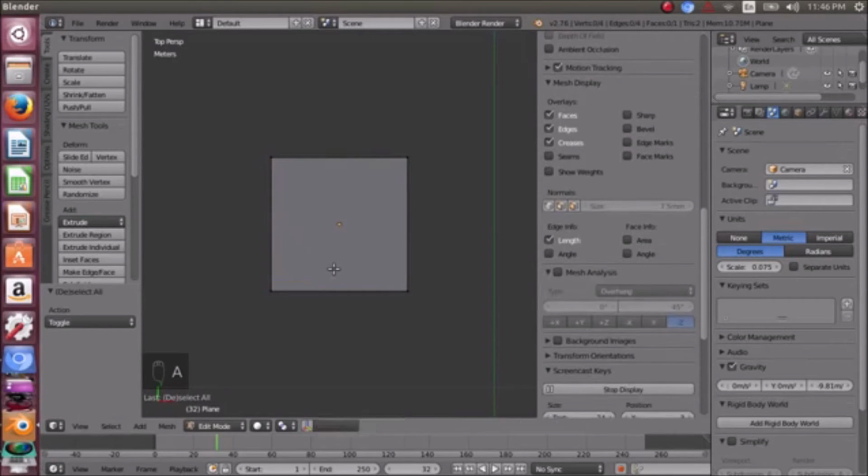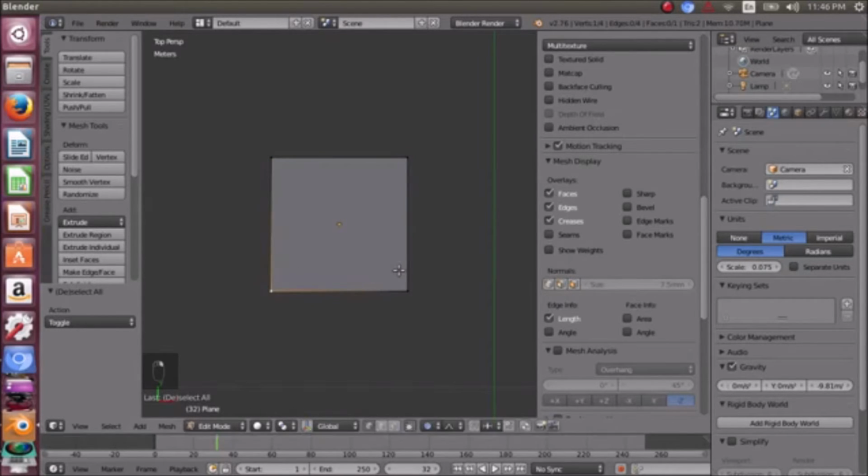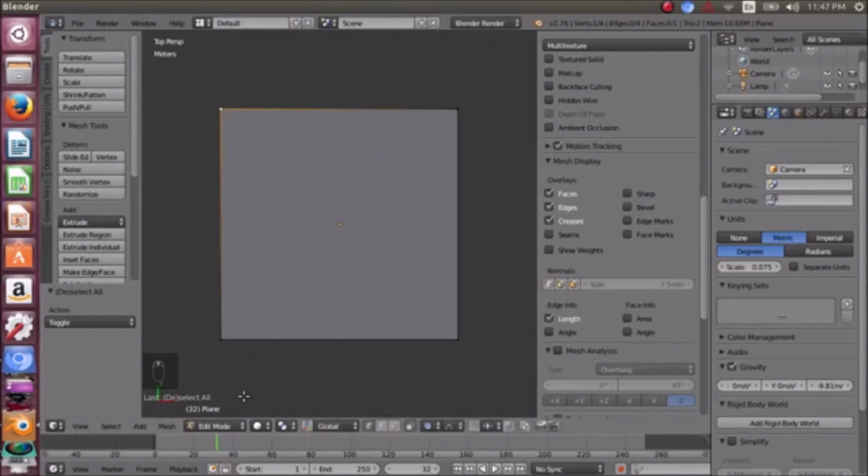Now, the one thing I was going to say is that while I could subdivide this, I'm going to avoid that, because I found out earlier I had forgotten the sequence in which I was building this pedal board, and so I got myself stalled out because of sequence in designing. I have in mind the overall dimensions for the design, and then the switches that are going to be applied to the board that I need to have placed. So when you're designing this, if you're working with inclines and slopes and everything else, I recommend working rough before you actually subdivide in the context of the switch.